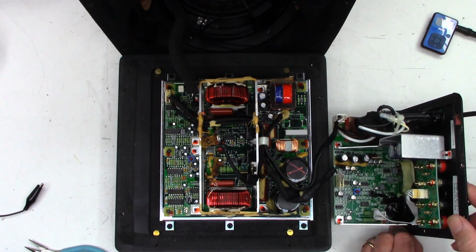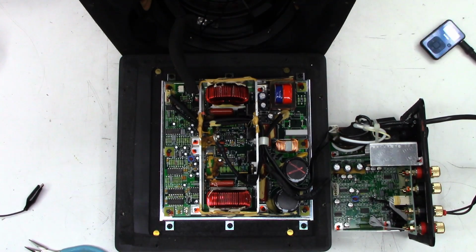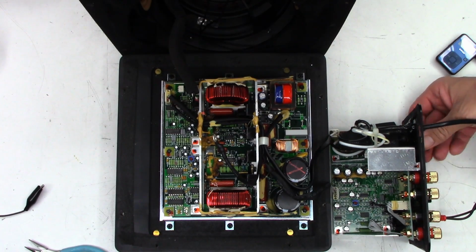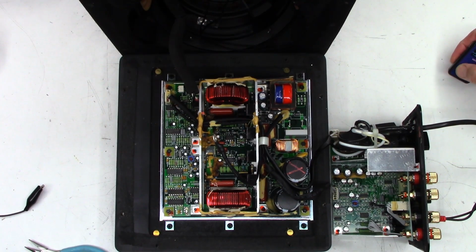And these are kind of a really fun time to recap with all the surface mount. And of course with all the glue. Does not help matters at all. Okay, so I've got my hot air rework station heating up right here. And I think we'll take it up to about 250, 300 degrees, somewhere in there. Okay, here we're at 250. Get the audio set kind of in the middle here. Checking my MP3 player. Audio is playing.